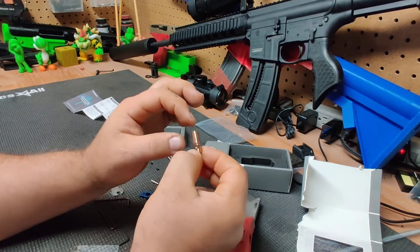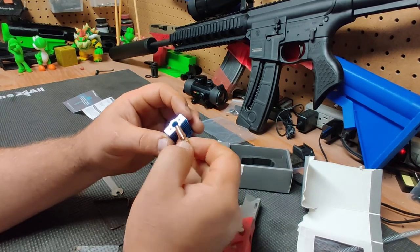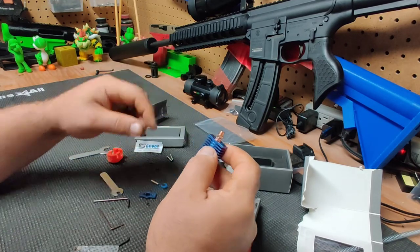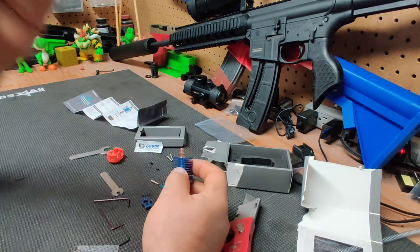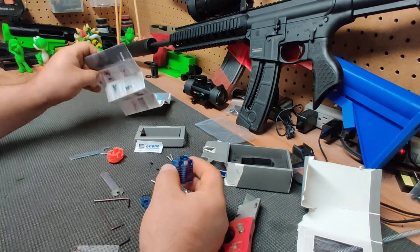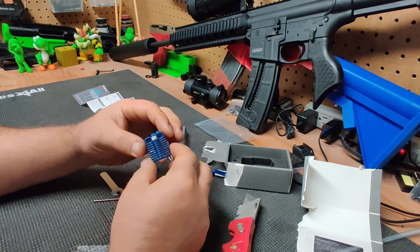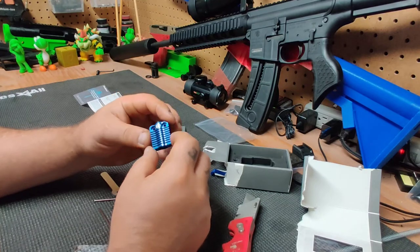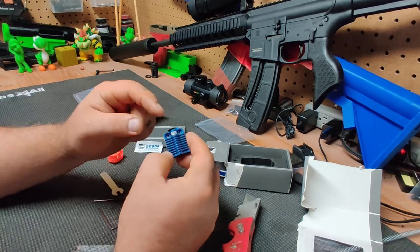This is a cone-shaped heat break. As you can see it was in there pretty firm — it just presses in and the cap holds it in place, keeps it from coming out. They also have a Dragonfly BMO that looks more like the V6 hotend. All of the lower parts are the same; the only difference is the upper part. This one mounts to the CR10-style machines and the V6 has the circular mount on the top.